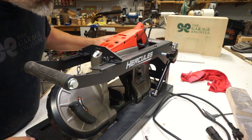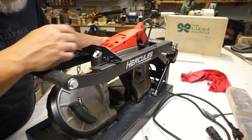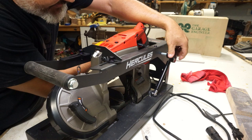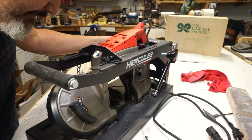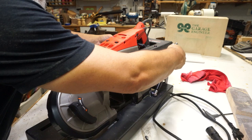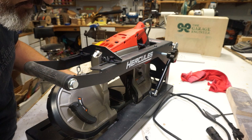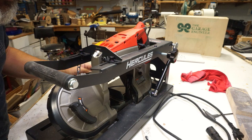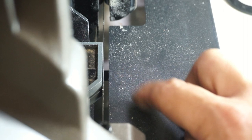What we need to do is turn the back adjustment here and it's going to shift the blade this way. You might need to loosen the other side some so you can push it more that way. I'll do a little bit more here — now it's getting tight so we've got to loosen this side a little bit, and that should be even. The trick is you want to tighten these down evenly, because tightening might move it a little bit, so you have to play with it as you tighten and make sure it stays. Take your square, put it up against the fence and the blade — you should not see a gap between the two, and that means you're square to the fence.